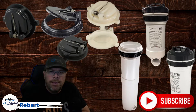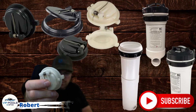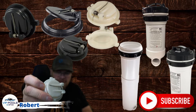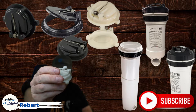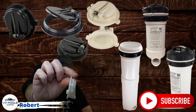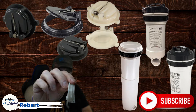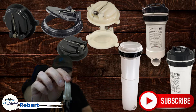In this video we're going to talk about the bypass valve — this little piece right here. The valves will fail if that spring gets all rusty and your water chemistry is out of whack. The whole purpose of this is that on high speed it opens up and the water goes straight through, so some of it bypasses the filter. On low speed it doesn't have enough power to push it open, so it forces the water up one side of the canister, through the filter, and out the other side — it filters a lot better on low speed.